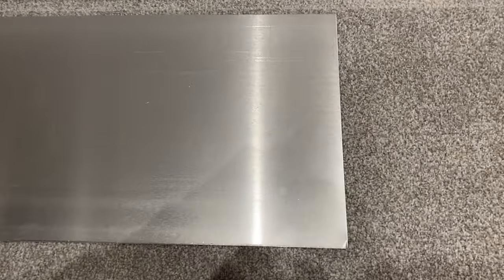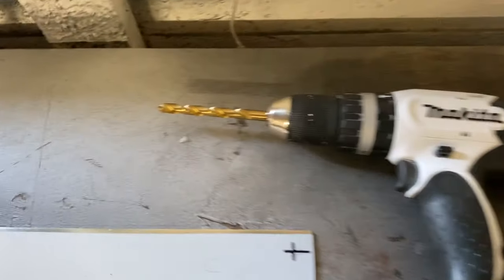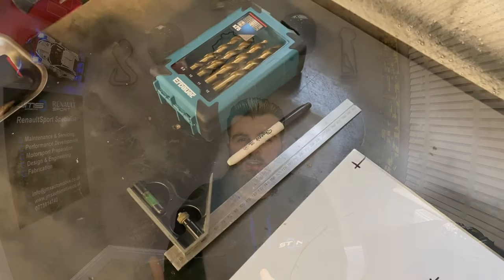You're going to need something to mount it to — I used a two millimetre sheet aluminium. It's nice and light. You could use steel but it has the potential to rust. It's strong enough and doesn't flex while mounted. I'll put the link in the description for where I bought it in the UK. The final bits you need are some assortment of drill bits. I used a nine millimetre mainly, to make sure all the holes for the mounts and how the car is secured are correct. This is more of a guide, not an exact how-to.